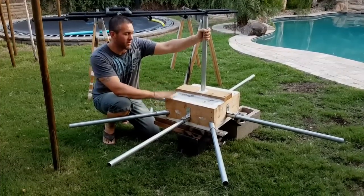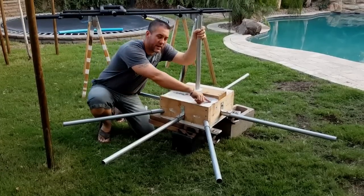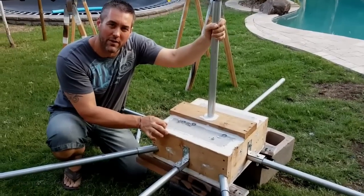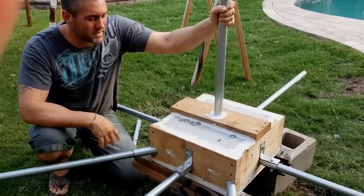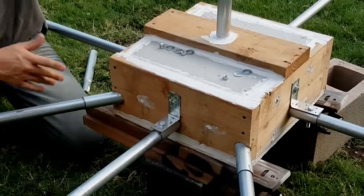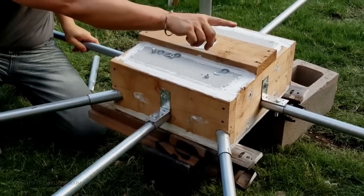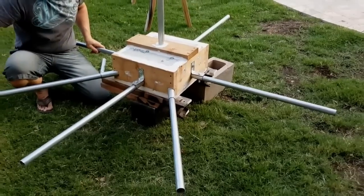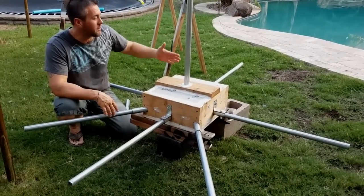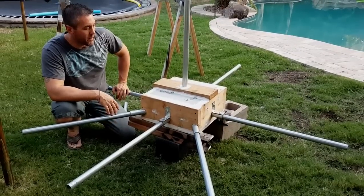You can see we've got our concrete poured in there. I've also done a couple of other odds and ends — I applied a little bit of caulking around the top and the same on the bottom just to seal up the gap between the cement block, trying to keep as much water out as possible for longevity. Everything's nice and sturdy. I actually cut my legs here — the tree will be seven foot diameter and it'll be a 180-degree tree. The base ring starts over there, comes out three and a half feet off the center pole and comes around this way. For a full 360-degree tree, you'd probably want one more support on each side, just like I have in the front.